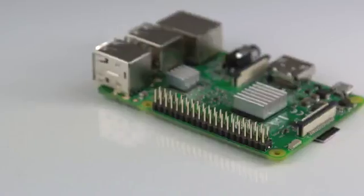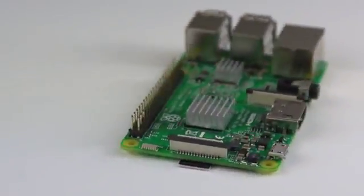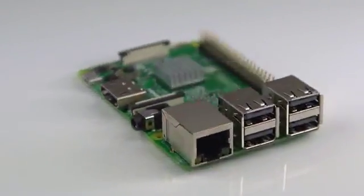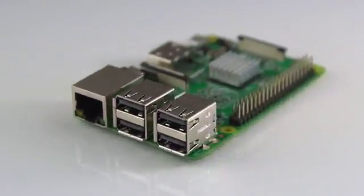The communications that we are exploring are Bluetooth, Wi-Fi, Bluetooth low energy, LoRa communication networks, and Zigbee as well. Now you can buy development kits off the shelf and put them together very simply. They all have their different advantages and disadvantages. They all have their different power requirements. But the communication systems for those are almost getting to the stage where it's kind of industry standard.